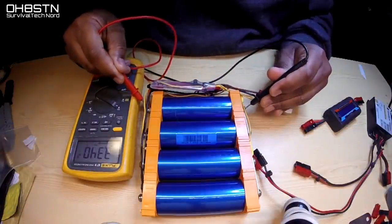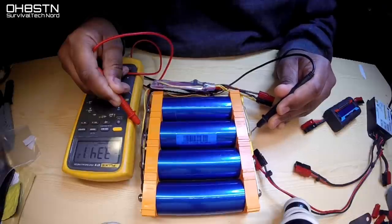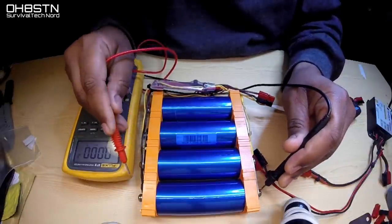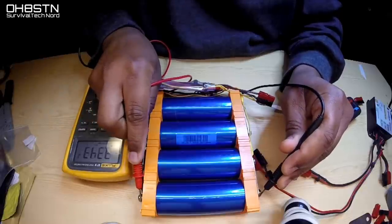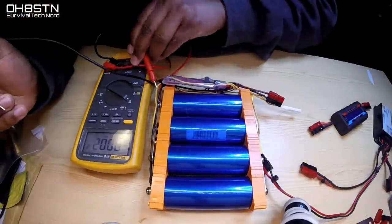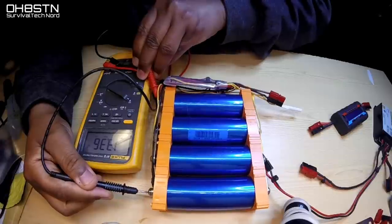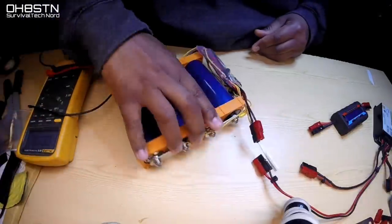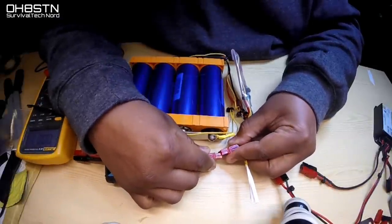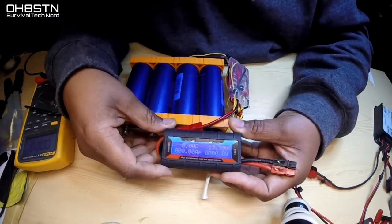Now it's time for the bench test. We're going to test each individual cell and then test the pack as a whole. After we're happy with cell voltage and total pack voltage, we'll switch over from the Fluke and put the inline voltage meter to see if the power pole connection is working on the other side of the BMS. The battery is happy and the Fluke is happy, so that's all good. We can connect the inline meter and if the BMS isn't working or isn't initialized we won't get any voltage — but the voltage is good, which means the BMS is working.